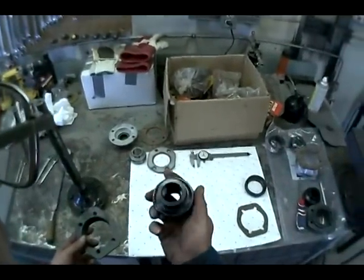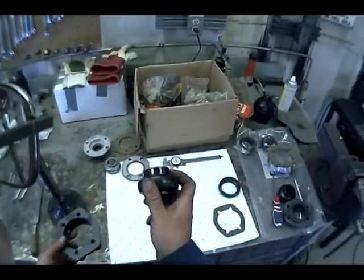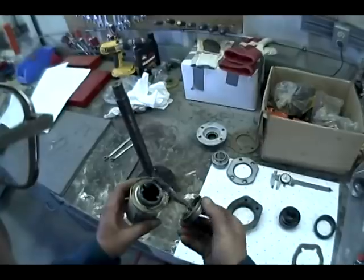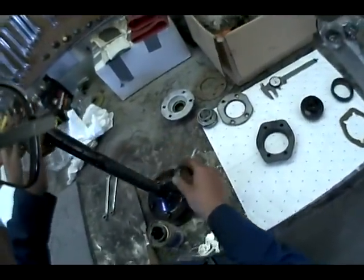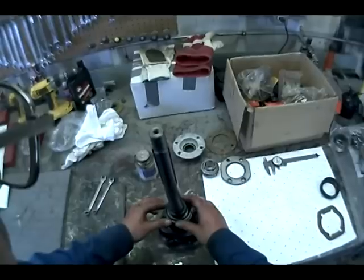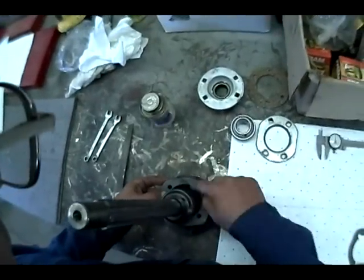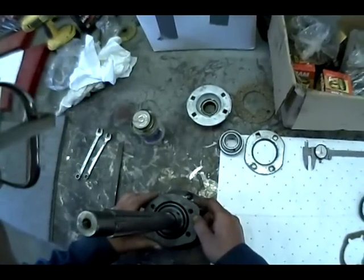First thing we're going to have to do is locate this bearing on the shaft and set our set screws, so it'll be a dry run first. And then we'll take it apart, tighten up set screws, and put the unit back together. Anti-seize for the shaft. Never forget your anti-seize on your shaft. It makes everything a whole lot easier coming apart down the road. And if you can, you're going to want to line up those grease ports. The grease nipple's on the top, grease port inside here, and then the bearing's got the hole here. Try to line them up as best you can.